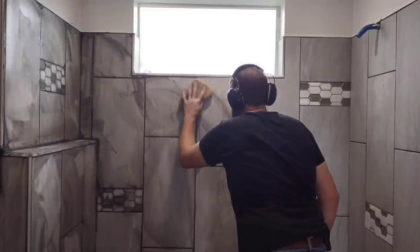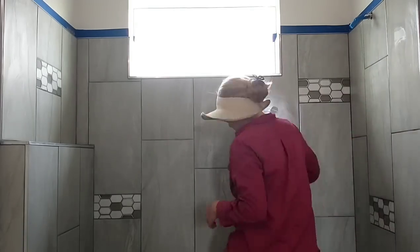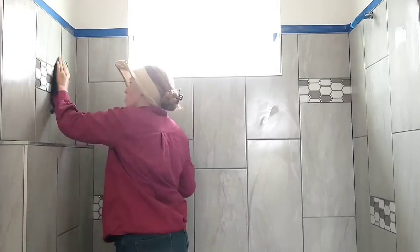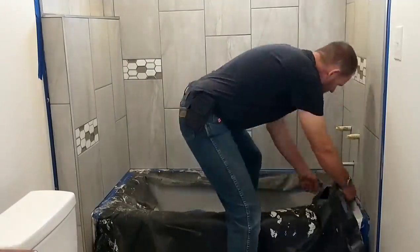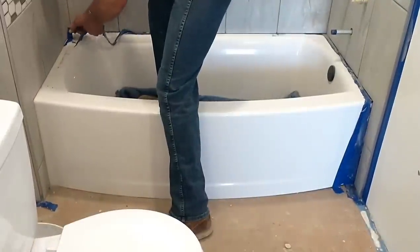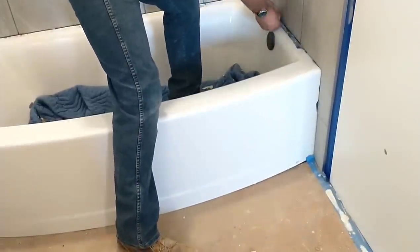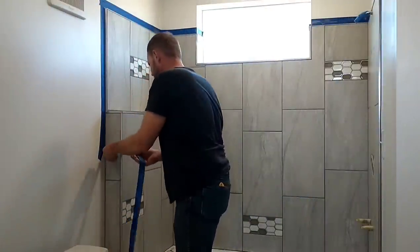The tile is now all finished and I'm ready to grout. This is a messy, miserable process that took a really long time and was extremely unpleasant, but I'm glad it's over. We used the same grout as on the backsplash so it all matches. April has come in to do a final wipe down and clean before sealing the grout. She put three coats of sealant on the grout. Now we're excited to remove the tape and plastic to see how it looks with the tub itself. Some of the tape around the base was a real pain to get out since it had gotten stuck underneath the tile.